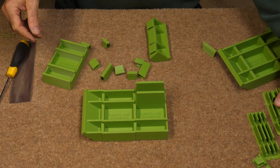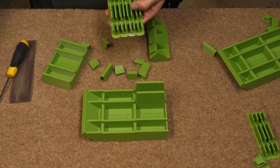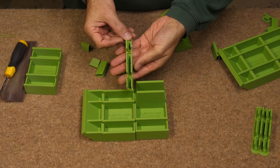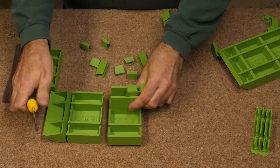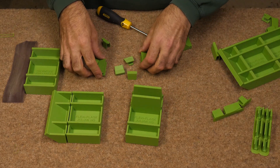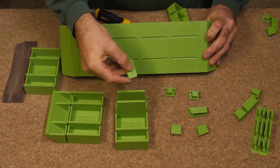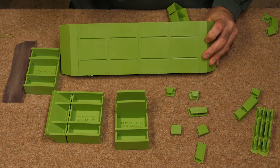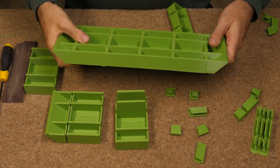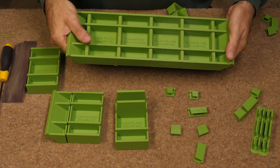Here are the clips — there are six clip types. When you first look at it, there should only be two: the larger ones for the centre, and the smaller ones for the top and bottom, and it's easy to print them in groups of three. But there are four extra clip types, and these extra ones are due to the handle pieces protruding into the clip area. Apart from these four special ones, all the other clips between the extension pieces and corner pieces are identical. Also, if the clips on one side don't work well enough due to strength or stiffness issues, I could add a set of clips to the other side too — the sand side — which would make it incredibly stiff. But I fear it would be so stiff that things would start breaking instead of being easy to remove.